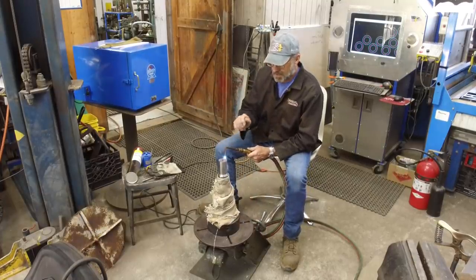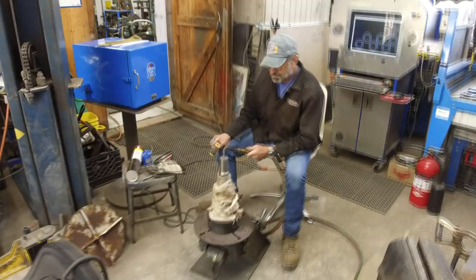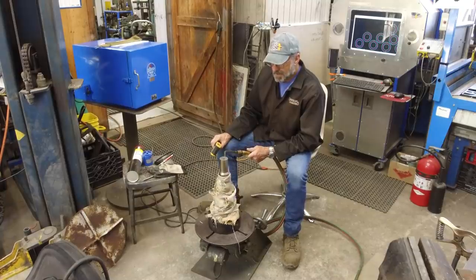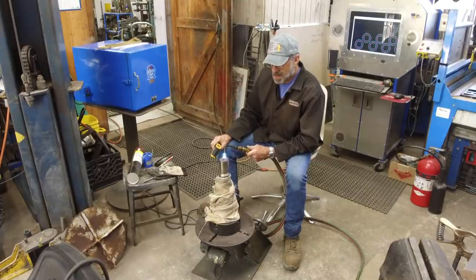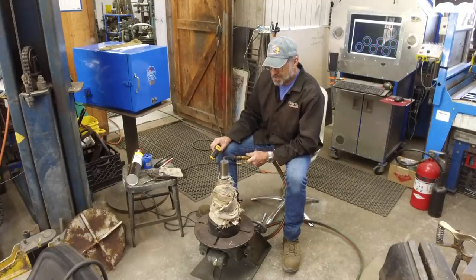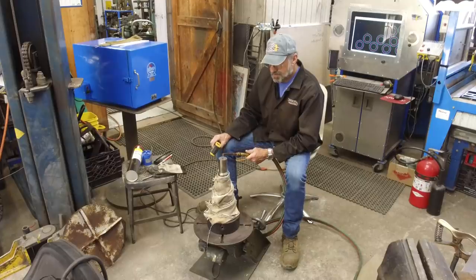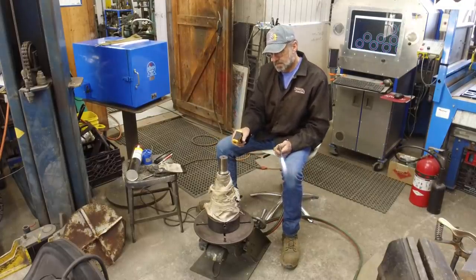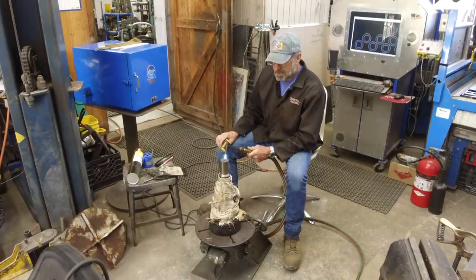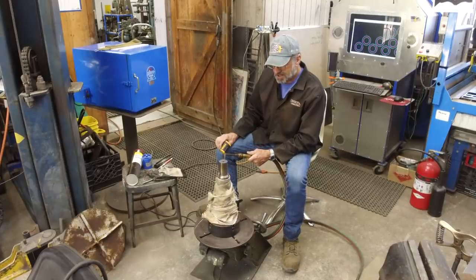We're just going to go ahead and switch the direction because when I go to weld, I'm going to be welding with the rotation in this direction here. I'm not going to try to get any arc shots in here. Jody at WeldingTipsTricks.com got some really nice arc action, and he's set up for more of showing you what's going on in the puddle. And he does have a lot of low hydrogen welding videos as well. Okay, we're up a couple hundred degrees already. But I will give you some shots of steps of the weld buildup as I go along at different stages.